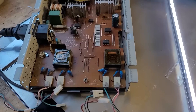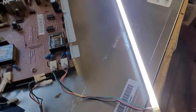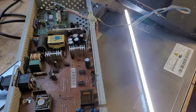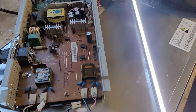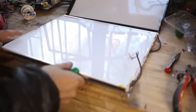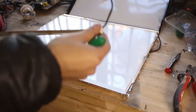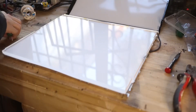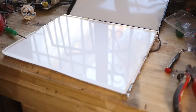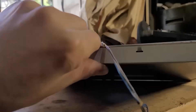Obviously, this is not only bad for the monitor, but it is not being illuminated correctly, leaving us with dark parts. What I did was directly remove the burnt tube and put in an original spare, as it should be. I took this spare from the other monitor that I fixed before, since it only had one of the two tubes burnt out, so it served to put it in this one. We put everything back together, and since it now had the correct energy consumption, it was working and it wasn't turning off.